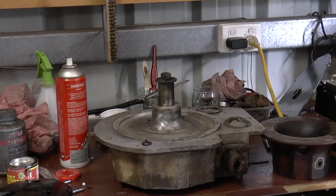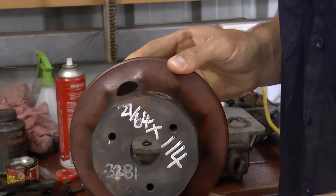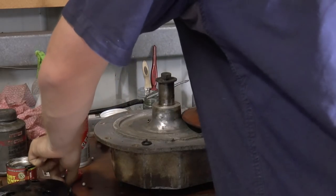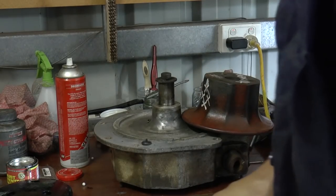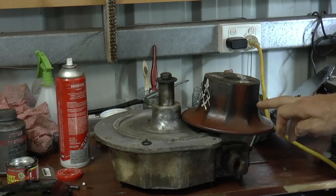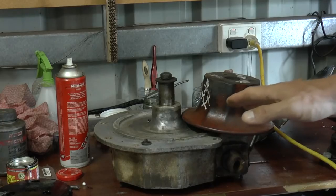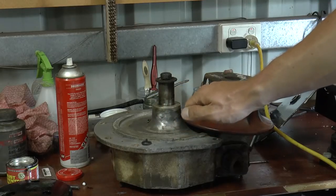On the bench here you can see an assortment of parts that make up the capstan winch. A fair bit's happened over the last couple of weeks, so I'll run you through what's gone on. First things first, we have the lower portion of the capstan winch here. What happened when I took it off the vehicle was that two bits of rod came out either end. This isn't quite right — there should actually be a shaft that goes straight through here, running through the turret through the centre shaft, and that creates the drive for the winch itself. I wanted to investigate what was actually going on in here: was there a shaft inside, had it snapped off, was it sheared in there, and if so was it stuck?